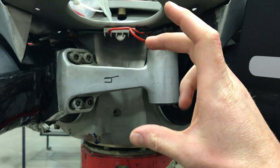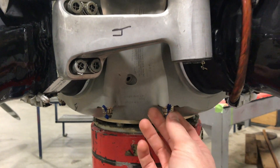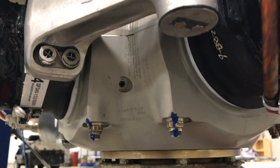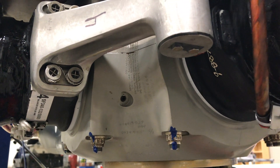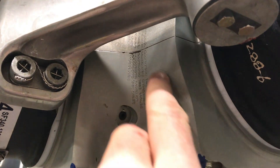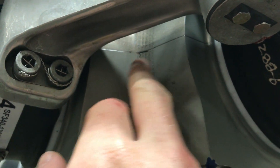You can see the split right here. The hub is in two pieces and the blades are trapped inside with their bearings and seals. These eight bolts are stretch-torqued to proper spec. These hubs are so beautifully machined — you'd swear it was just one solid piece. These need to be sealed, so you put a very small bead of sealant around the halves before you mate them together. It could just be a minute amount, but by the time you torque the hub down it looks like you put so much on there because it squeezes it all out.